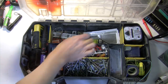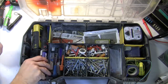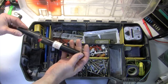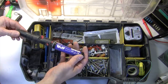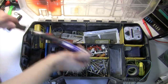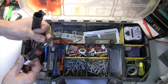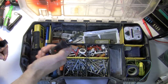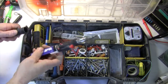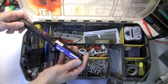A little battery torch. A lighter — not for cigarettes, that's actually for working with heat shrink. Speaking of heat shrink, I've also got this Wolf gas iron. It allows me to either put a soldering tip end on or, as it's got here, just a hot air vent — and it's self-igniting. It actually has some gas in it, which is unusual as I normally need to charge it when I need to use it. It lets me do soldering or work with heat shrink quite well.